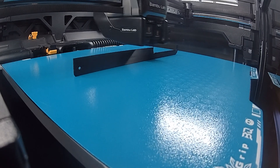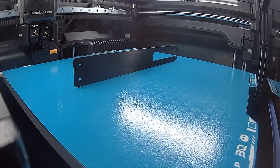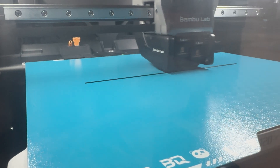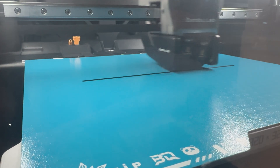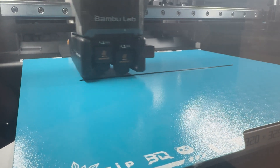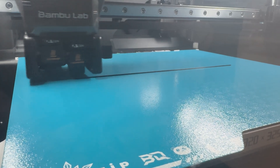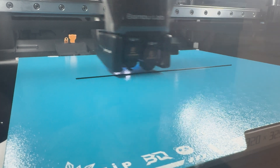So I thought, let's give this new plate a go — it's free. And it worked straight away. I reprinted the same part but dropped the build plate temperature, and it worked again. I dropped it again to 30°C and it printed perfectly. The part is basically just two very thin lines on the build plate that the nozzle runs down, and it built up perfectly. I tried it with time-lapse on and off — same as what I did on the old build plate — and it just kept working. It's sticky; what more can I say?